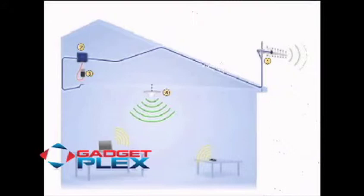The good thing about a directional antenna is you get more gain because you can point it in the right direction. You're not wasting signal around — that's the good thing about it. The downside is that it doesn't work very well for a mobile environment like an RV.